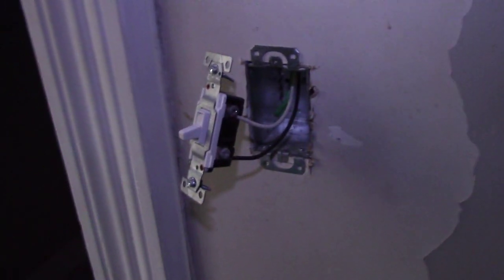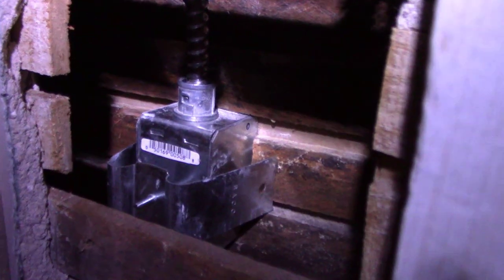Okay, I didn't film this, but I obviously cut a hole in this wall here. There's our switch wired up, just the white and the black wires. We've got our ground, which is the actual box itself, since it's metal. I had to cut a little bit of an access for me to get in there, but there it is from the back side with the rough-in box, the wings, mounted solidly, and then the whip is going in there. All right, now I'm going to turn on the electrical and we'll test out the lights. Nice. We now have lights.